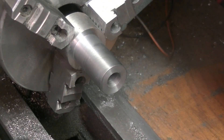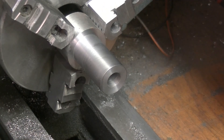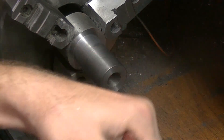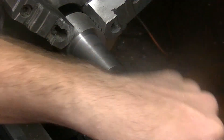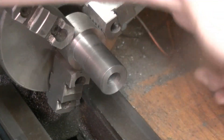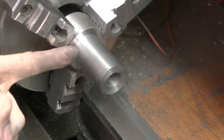255 — this hole is from previous machining. We need to drill it all the way through right now; it's just a blind hole. Get all these chips off the lathe. We're going to do that next, then bore it to size, and then start parting off rings.